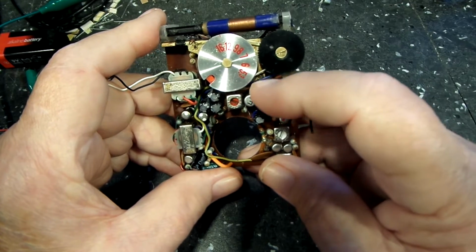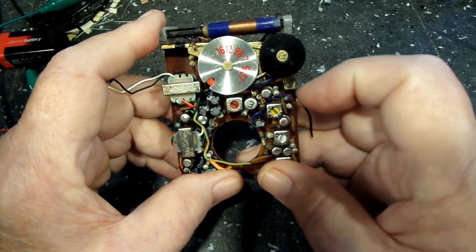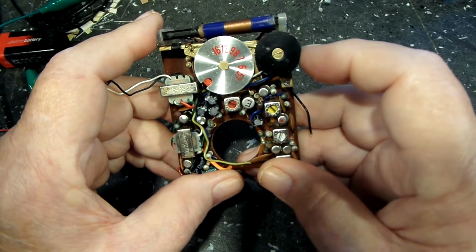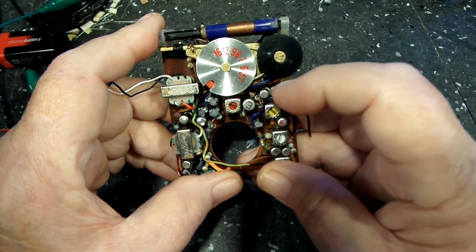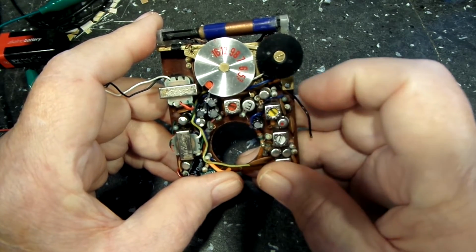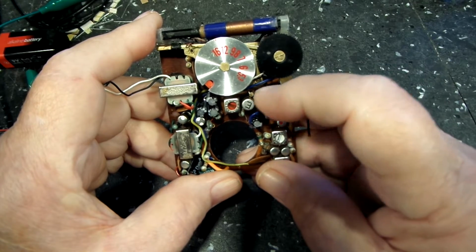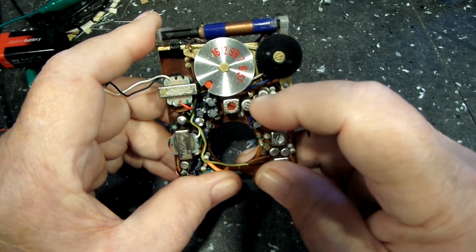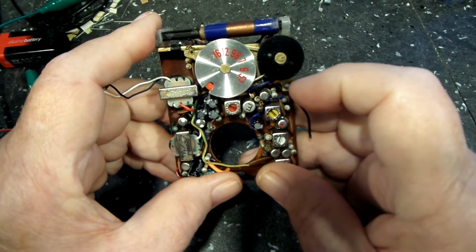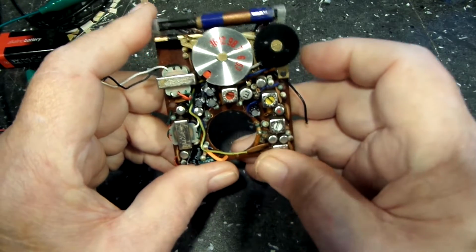Now, that's the primary thing. The secondary thing is to check the actual transistor used in that application, because I believe, and I can't be totally certain because I don't have it anywhere on video that I can remember, that this transistor in the brown radio was a different value than the original. It wasn't the 2SA160. I know that. Or I think it wasn't, anyway. So, like I said, if it does work, then we're going to try to find that replacement, or at least find some specs on it to find out how it specs out compared to the ones we've been trying here.